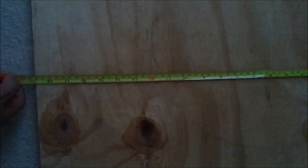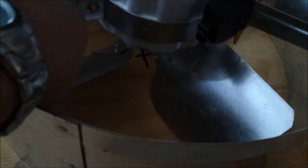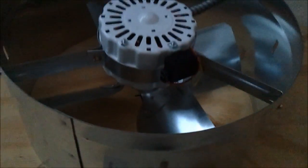Alright, so if you notice, we're working with 19 here, and half of 19, it's going to mark it down. If you measure somewhat correctly, you should be pretty good. When you draw your two marks, they should intersect, forming a nice cross. Alright, and now go on, try to line your housing up so that this center point is right over that cross as best you can. Keep in mind, make sure these lines or slits where they cut are going out of the diagonals.